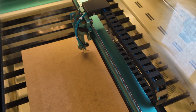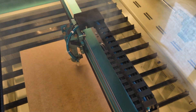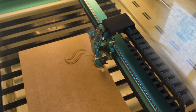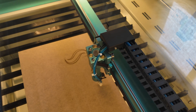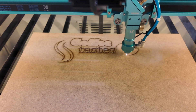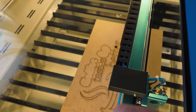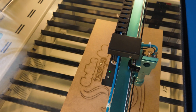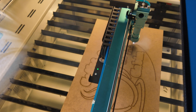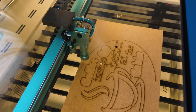Now I can close the door and press Start to begin the job. In the event you need to step away for a moment, you can press the Start button again because it says Start/Pause — it will pause the job and stay exactly where it finished. When you come back, press Start again and it will continue without missing a single dot. It's important never to leave your laser unattended — something could catch fire or the material could flip sideways and catch the laser head.